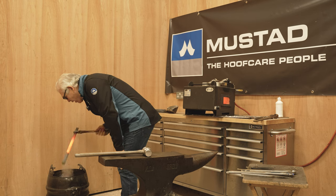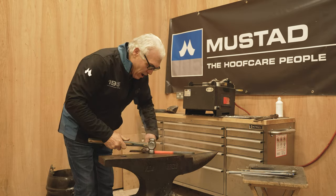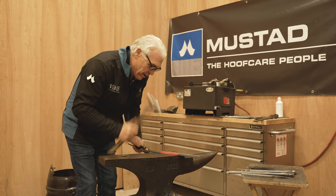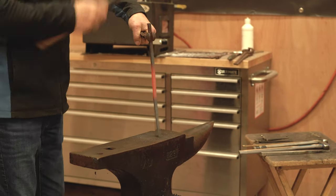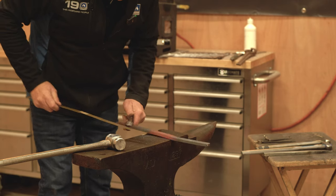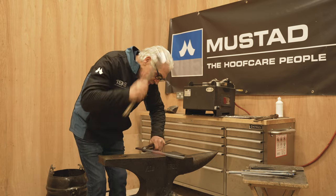We're in the heat — it's a bit wider than where the toe nails are going to go. I'll put about half an inch into the toe. It's very important that we keep the bars straight when bumping — we want the energy going into the material, not being lost in a bend. Planning on a half inch.